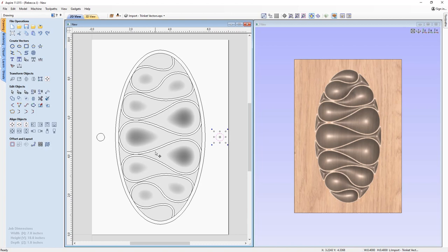We're also going to take the reverse of that on the bottom side and machine it into the spoil board so that we can get the alignment when we flip that material over. Now this isn't a wrong way of doing it, however I feel that this way, because we've set up the dowels in a symmetrical fashion, you do run the risk of flipping your material over the wrong way.